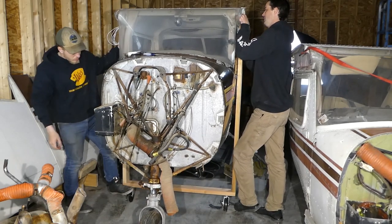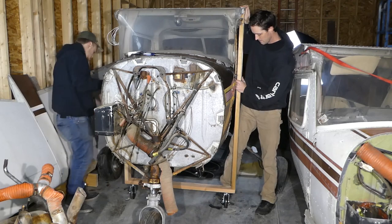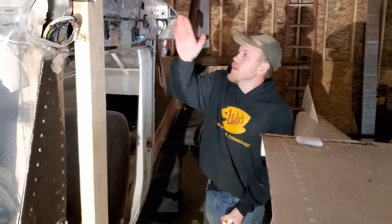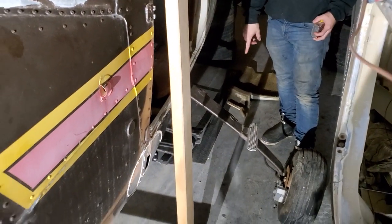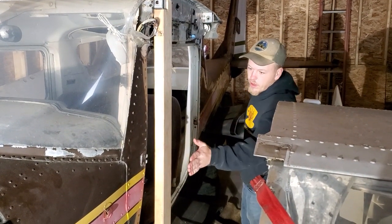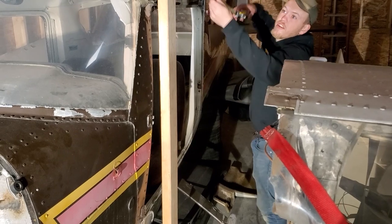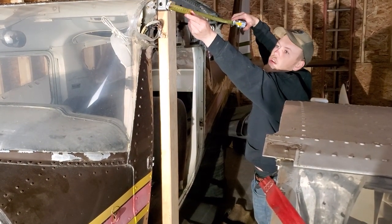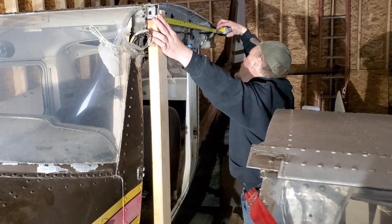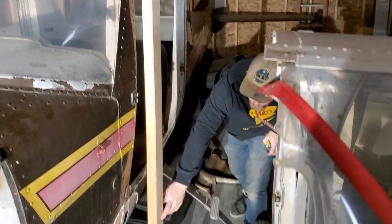The back upright is done. It's going to come down without wheels and just sit on the floor, so we can tilt it up onto the two front wheels and move it — makes it a little easier. We need a brace from the front leg to the back leg, and a brace across the two back legs. We measured that distance at 32 and three-quarter inches, which will be the length for both cross braces.